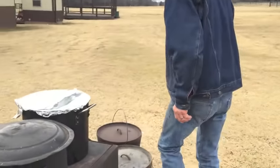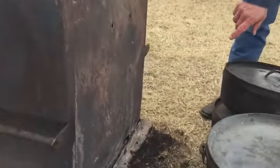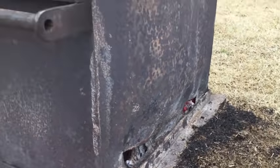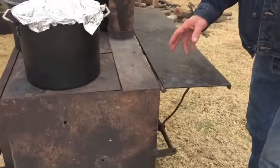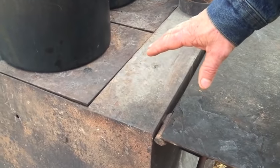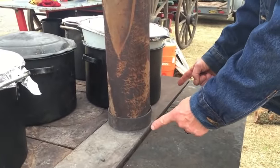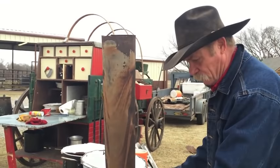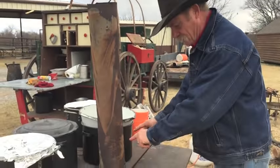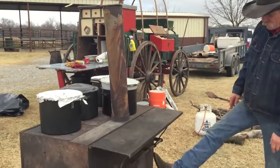Come on around this way. You can see that old Bertha has got two vents in her here — that's all she's got to draw, and she draws plenty well. Most everything on here is 1/8 inch, except right here on the top of this, this is 1/4 inch plate. Right under the flue of this pipe, there is about a 12-inch piece of channel iron that's welded up here so it's not a direct draft up through here — it has to come in from both sides. Slows that fire consumption down a little. You can see the warm inside.